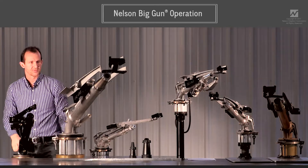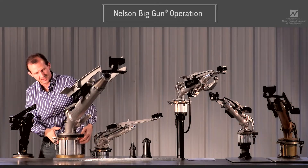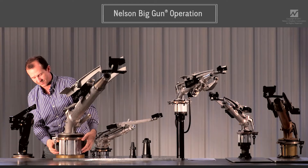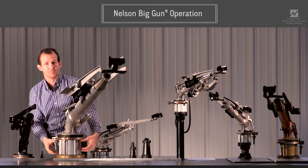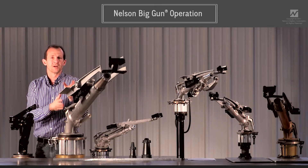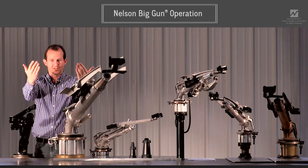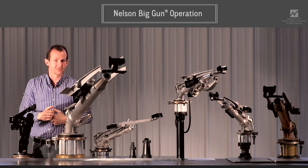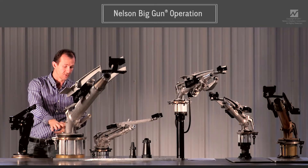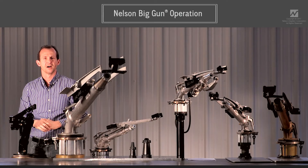Those are the basic principles of operation on how the sprinkler rotates. In both the full circle and part circle, all of our sprinklers have a lower unit which consists of many seals and two very large ball bearings, as well as a braking assembly, which prevents the sprinkler from operating too fast. You don't want your sprinkler to operate too fast — if it's running too fast, your water starts to come back towards the sprinkler, and you don't get the maximum distance of coverage that you get with a properly braked lower unit on your big gun.